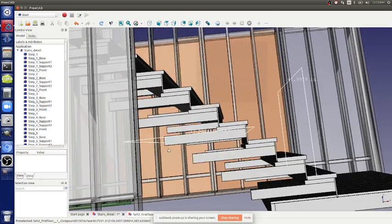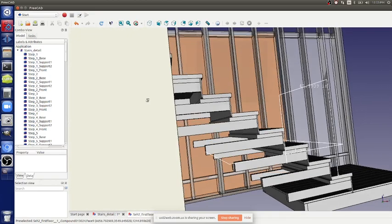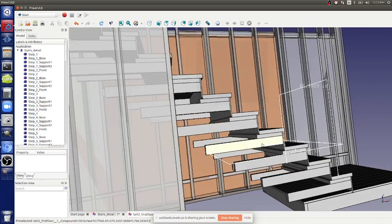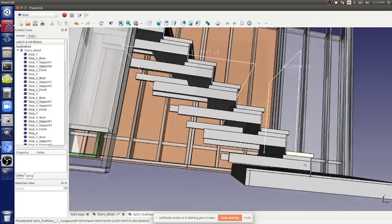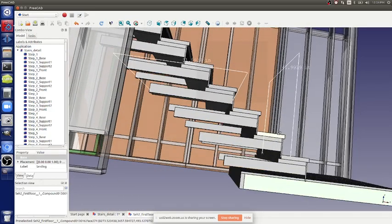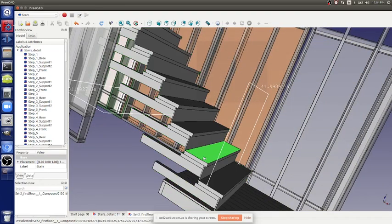We said 32 so that everywhere they will hang across two vertical studs. Vertical, yeah. So 32 allows us to just do that. 32 is fine. Okay, so we don't have to measure. Those are 2x4s. These are 2x12s here. Sorry, 2x6 right here. The rest are 2x12.